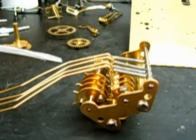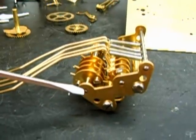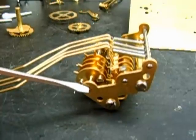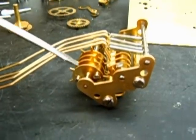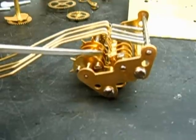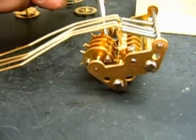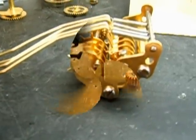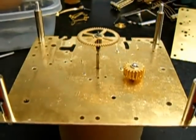I just wanted to cover lubrication. You can put some heavy mainspring oil — either the light or the medium — on this area right here, as well as the other area for the chime barrel. I would use some synthetic grease on the face of the teeth. Just put it on one tooth on each one of the discs, and as it rotates it'll spread the grease to the appropriate areas. The idle wheel is reinstalled so it can transmit the power to the rest of the chain.